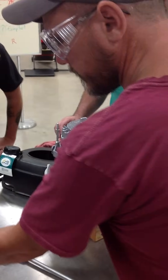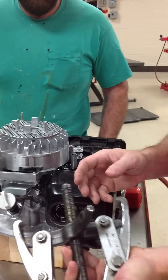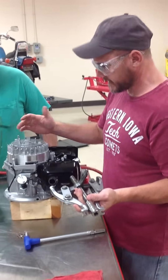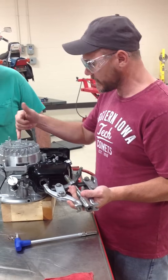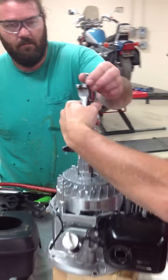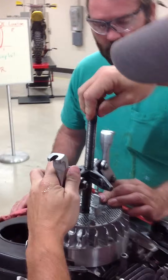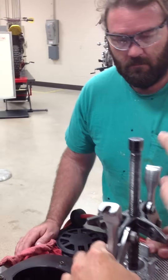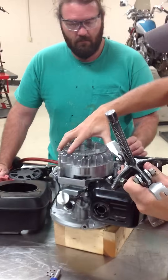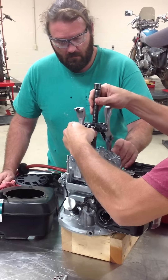Go ahead and grab your puller and start to set that up. Ross is talking about the puller itself — go ahead and talk about what you learned in class. We'll put some lube down here on the tip and on the threads; it'll just make things a lot easier, won't stick and wreck the threads, and mushrooms less easily. Parts come apart a little bit easier for us. Now sometimes once pullers are in place and being difficult to pop, it's common practice to take a hammer and beat on the end of the puller, which mushrooms the edge. We actually had to file the tip of this puller off so we could get our socket back on.